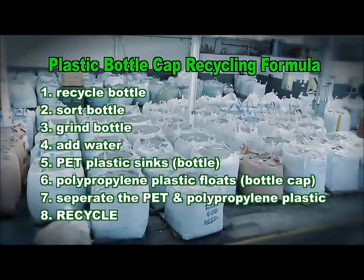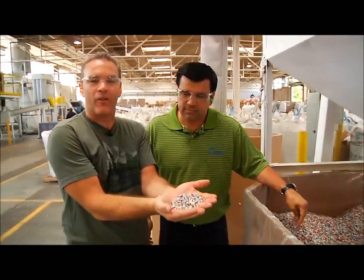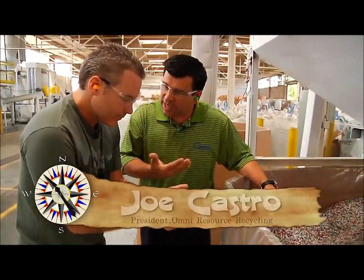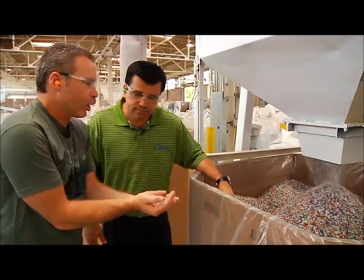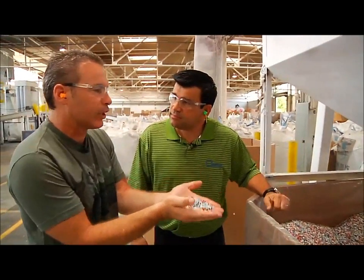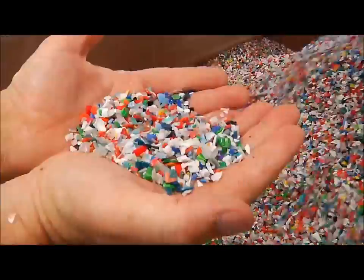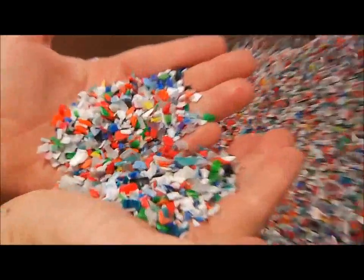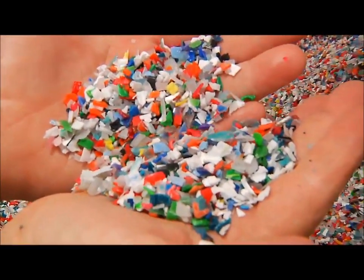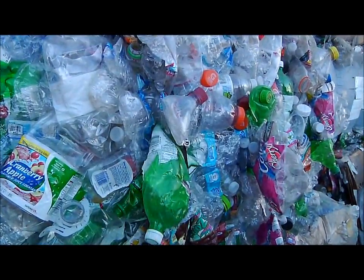And then at the end, what we have is clean bottle caps. Now I can see all the bottle caps — where before it was mixed with the labels and the PET, now you can see it's just 100% bottle cap material. Nadim said they separate the colors of the bottles themselves, and I asked him if it matters what color the caps are and he said no. Why is that? Well, when we're blending them together in the melt process, it actually blends together and becomes a gray material, and that lends itself to a variety of other colors — the obvious ones would be black or gray, or if you add some additional color you're able to go other colors in the end product.